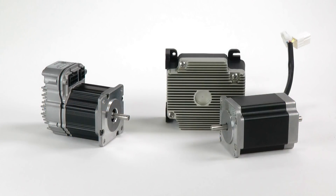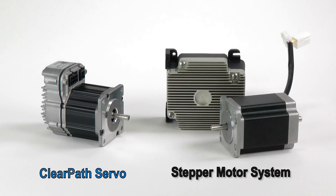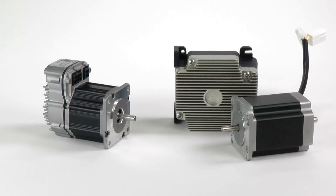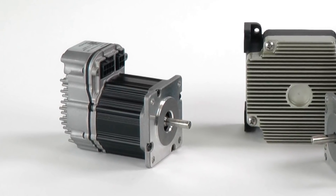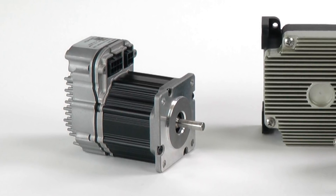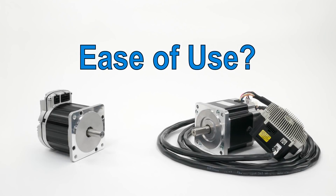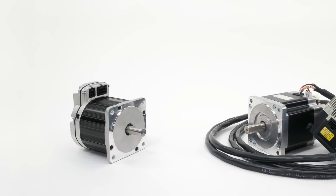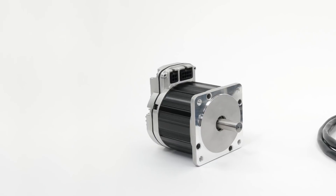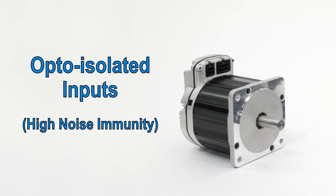So compared to a similar size and power stepper system, this ClearPath motor costs less, is smoother and quieter, and is fully closed loop so it doesn't lose position — and it has a 12,800 count per rev encoder to ensure its accuracy. It's actually easier to wire a ClearPath than the stepper because it's all integrated into one unit. The step and direction inputs are opto-isolated, so it's extremely resistant to noise. In fact, we've used these on a CNC plasma cutting machine using 60-foot long unshielded cables with no noise issues whatsoever.